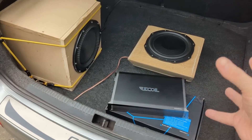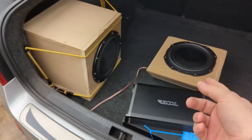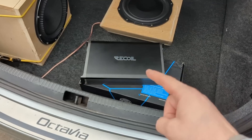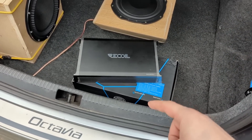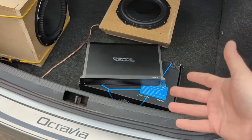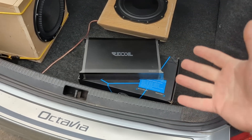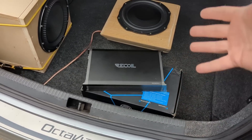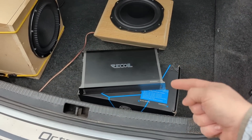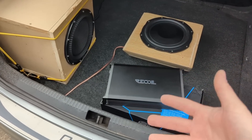When we have a subwoofer and amplifier combination, really two things come into play affecting the sound. First is the amplification itself. As part one of this test we'll look at how this amplifier reacts into different loads at exactly the same output power — say 50 watts — measuring distortion at eight ohms, four ohms, two ohms, and one ohm to see if there's a difference. I will be measuring on static resistive loads.